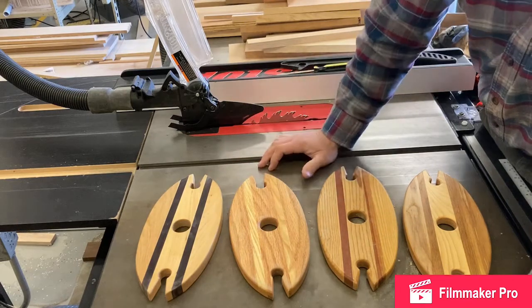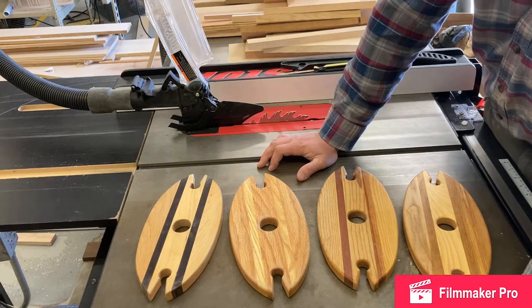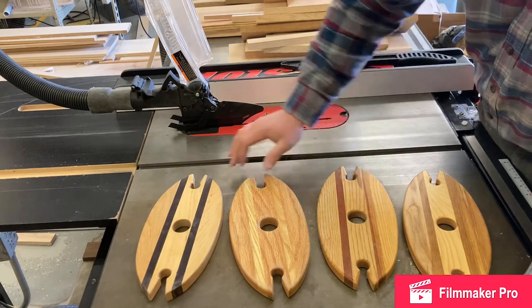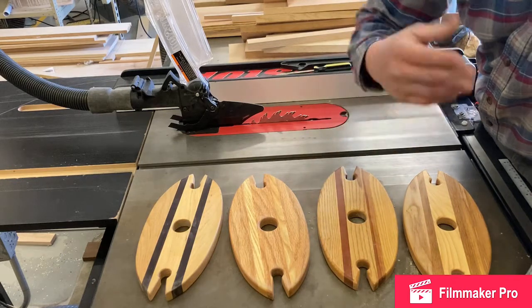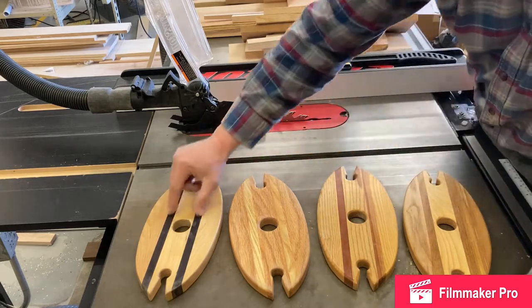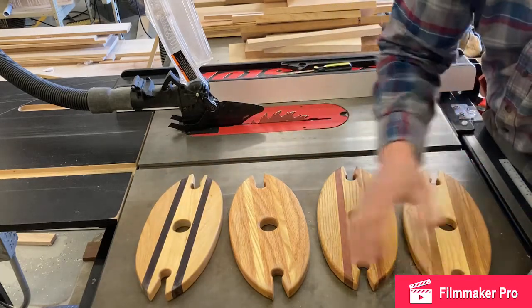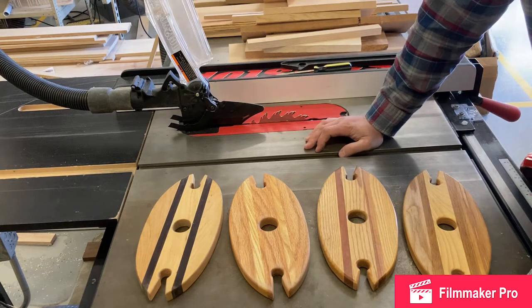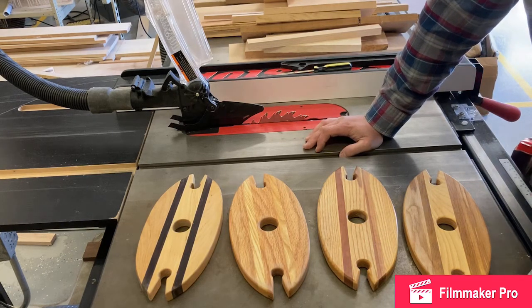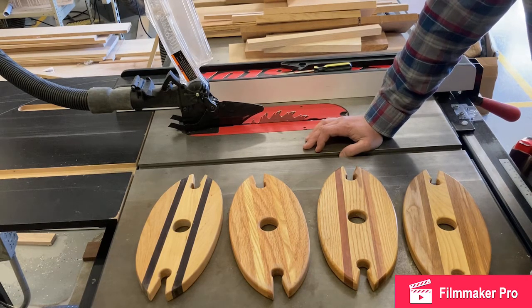A lot of times they call it a curly maple. When we order, it's called a soft maple. A lot of people call it a tiger or a curly maple. And it's got really nice curls kind of in the wood if you do it right. Now this over here looks like black walnut, but it's actually not. It's a roasted poplar, and it's not anywhere near as hard as the walnut, but it gives us the walnut type look at a price that's about a third of the cost of black walnut.